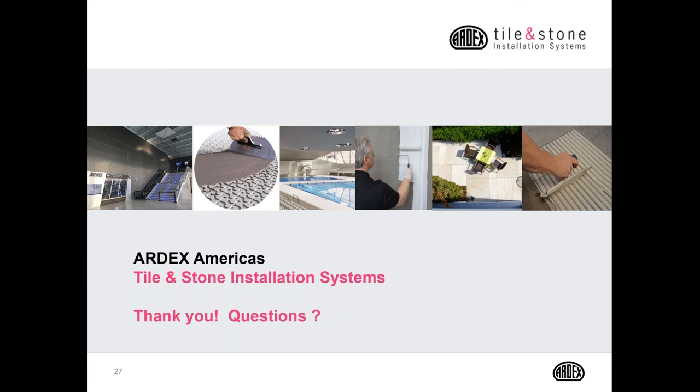It's mostly going to be in your rough natural stone applications. We have a question from Norma. What does WA stand for? That's a good question. There's really no meaning behind WA. ARDEX is a German company, and they have the naming of these products, and they don't particularly mean what the product actually is. So in the ISO standards, WA also stands for water cleanable and abrasion resistant in reference to grout. That is an explanation I use when describing WA.